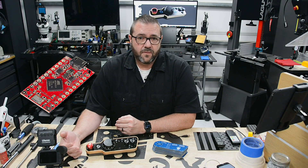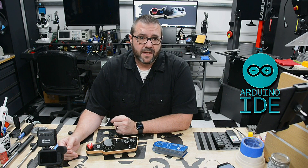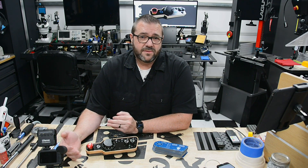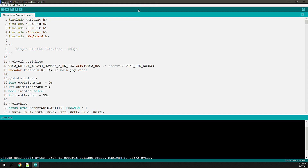The Pro Micro is an ATmega32U4-based Arduino, so programming it is easy with the Arduino IDE — Integrated Development Environment — the software application that allows you to write computer logic and upload it directly to the board. In the Arduino IDE, I open a sketch, basically the script that will be compiled and uploaded to the device. At the top of the file are includes: libraries that others have created to perform complicated activities like configuring and sending graphics to the display, listening to the jog wheel and reporting its position and direction, and configuring the device to become an HID (human interface device) to easily send hotkeys to the connected machine.